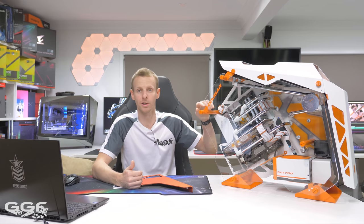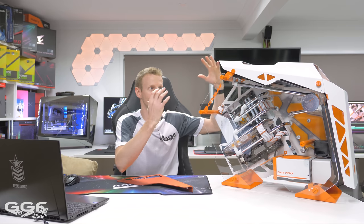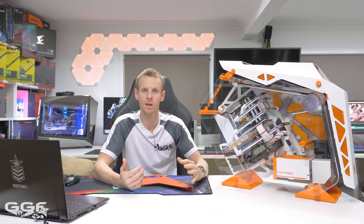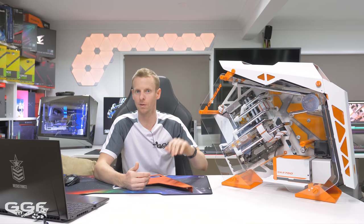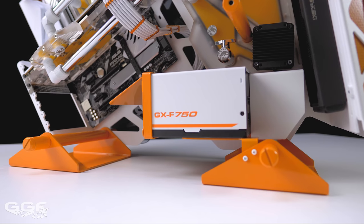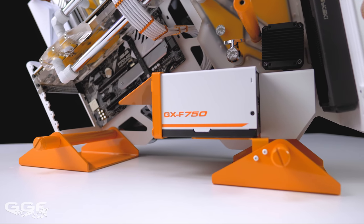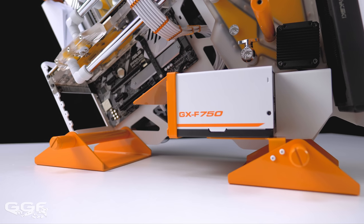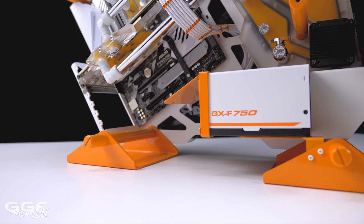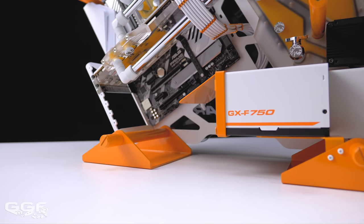And especially this is going to be shipped down. Once you start putting foam packaging around, if you haven't let the paint cure for long enough, it'll all stick and it'll start to come off. So definitely had to go powder coating. I got some powder coated in a gloss orange and some powder coated in a matte white. They call it a Sahara white, which is meant to be fingerprint proof, which does actually work pretty good. So yeah, I got those two colors done.